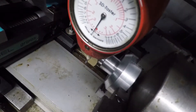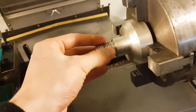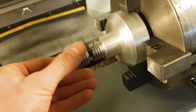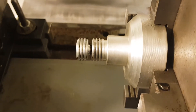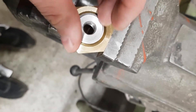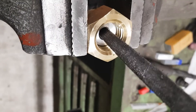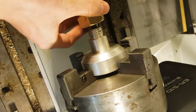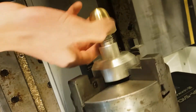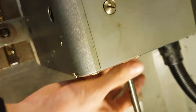To get the offsets in X and Y, a 3D edge finder was used. I initially planned to go for a setup where the M24 nut thread pressed it against the tube, but eventually decided to center it on the thread. Centering a workpiece on a thread is not ideal, but in exchange for the additional clearance it seemed well worth it. Now a smaller M10 thread is responsible for holding the piece, pulling on an M24 insert.